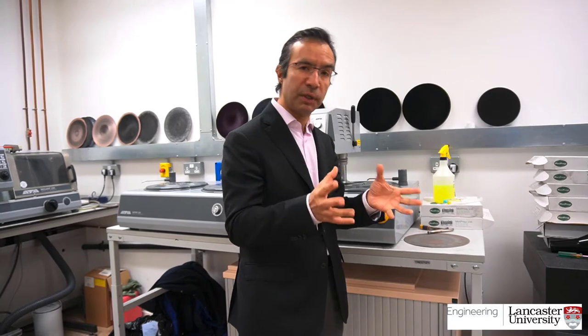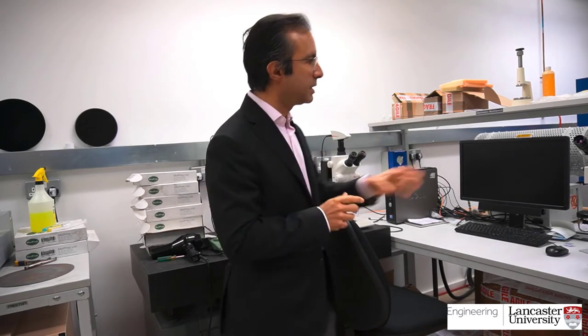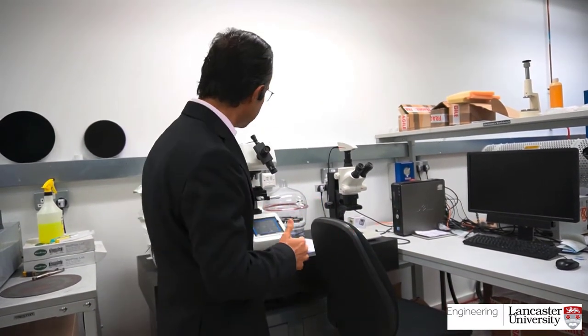Some of those samples, sometimes before mounting them or just inspecting them, we would like to have a coarse microscope. So that would be this — it's almost like a magnifying lens with a camera installed on it, so magnification is low. But as opposed to that, we have this optical microscope which has a magnification of about a thousand times. That means that we can see features that can go down to one thousandth of a millimeter — the micron range. A lot of these samples and applications are very interesting in terms of understanding how hard they are. And this is a hardness tester.